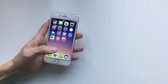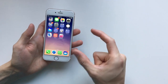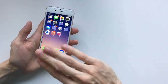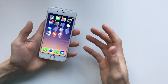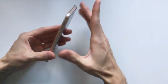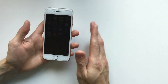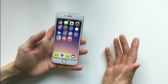So I was looking online and it seems as if the problem is the IC that controls the touch screen. It's obviously on the logic board. A few videos suggested that you open up the phone and reach the IC and put a piece of tape on it, so it would apply pressure. The actual fault is that the soldering under the IC comes off because of the bendability issue with these iPhones. By putting a piece of tape on top, it would make some pressure on the IC and fix the problem. However, that didn't work for me, so I decided to try my own way.